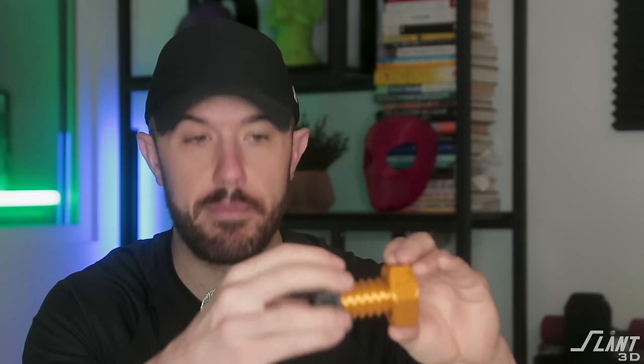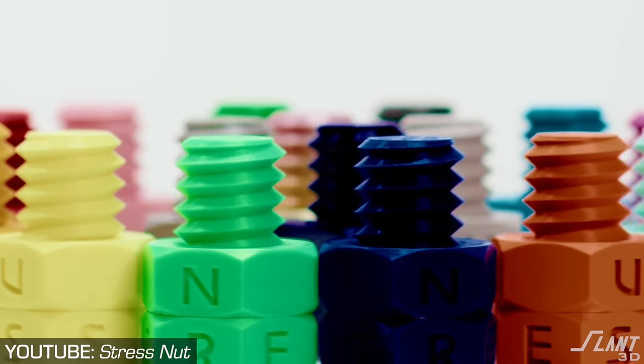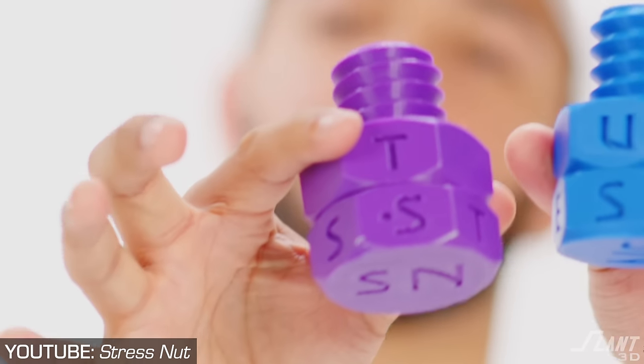Let's go ahead and just look at the design of this thing. Overall, it's a very good design — very manufacturable. Since it's only two pieces, which is very simple, it's easy to produce at scale. Each feature is already pretty good: the text is on the side, and the threads themselves are large, chunky, and easy, with a fairly low tolerance between the two pieces. So you don't have to worry about fit and feel to still get that really nice spin and connection.